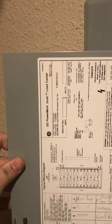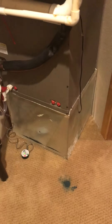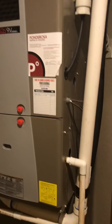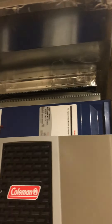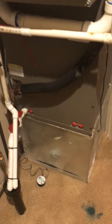All of the panels are GE. Down-flow, seven-eighths line set, short line set up and out, two-inch reducers to three-inch flue pipes. 20x20x4 electronic air cleaner out there. It's 14-gauge wire, white Romex, down-flow.